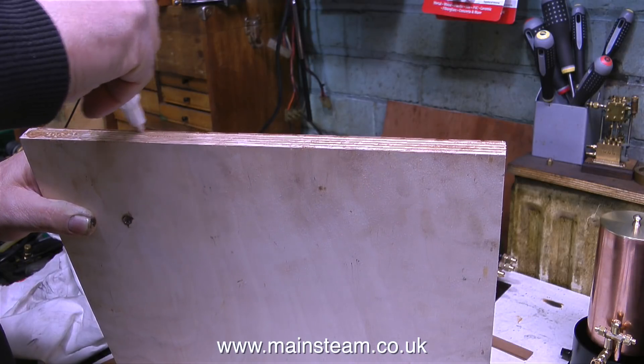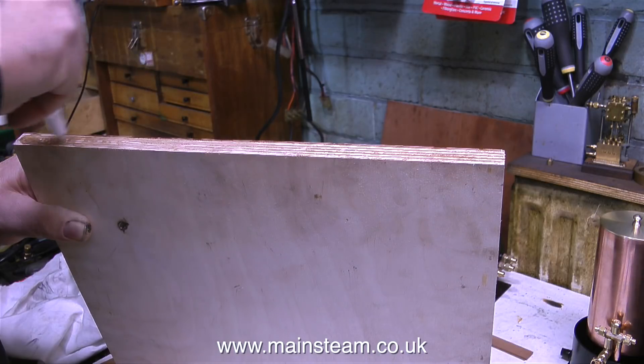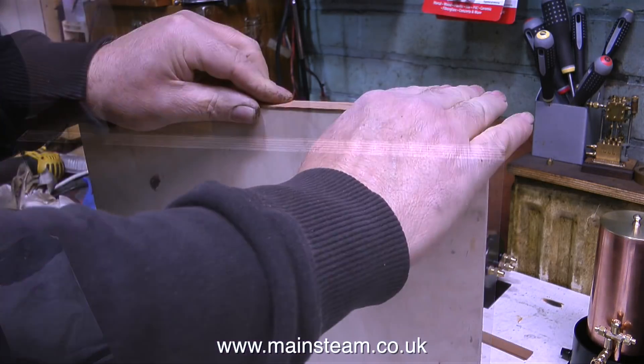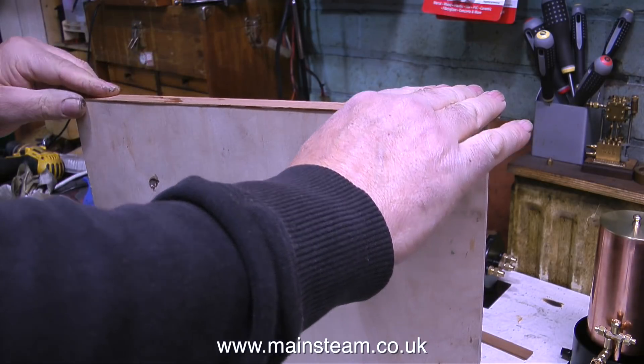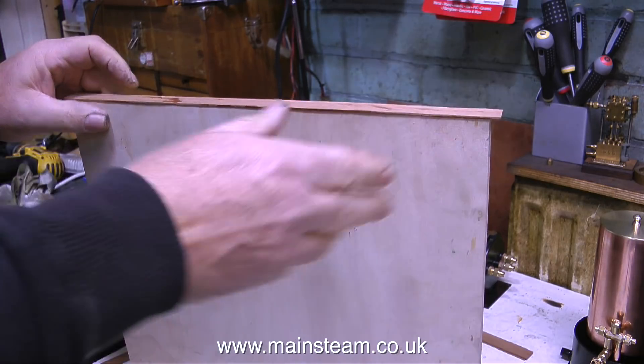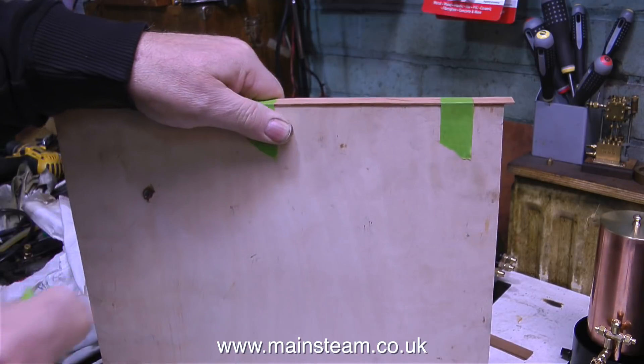In this video, I'm actually finishing off the baseboard. I've fully veneered the top, and it's really set very well — every plank is firmly stuck down. So all I have to do now is stick some mahogany around the edge. Because of the width of the baseboard plus the top planks, I have to cut the mahogany to size from a larger piece.